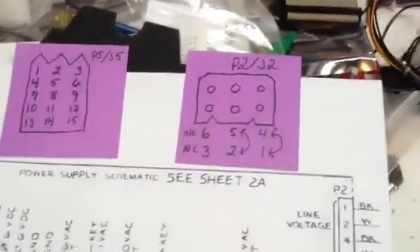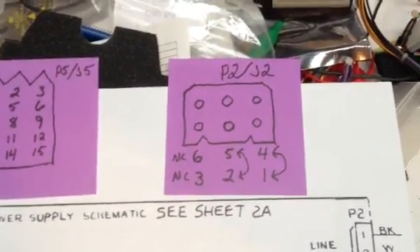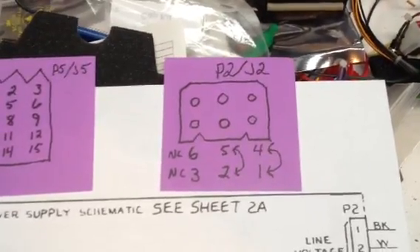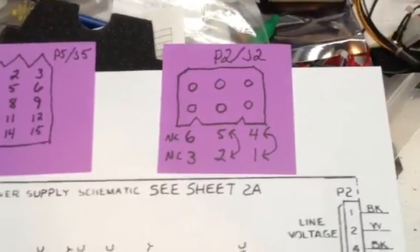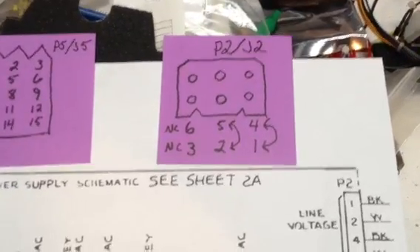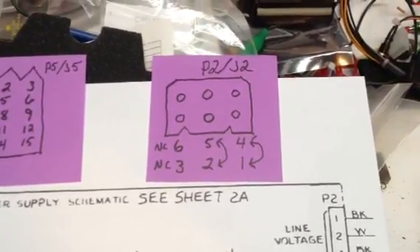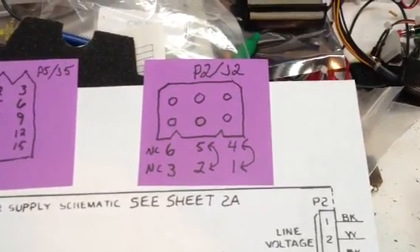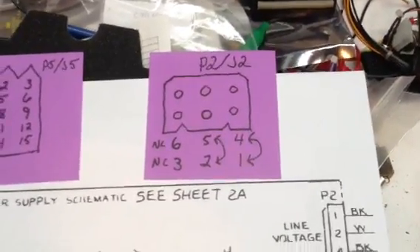The pin-out on these things I've drawn — and I'm not the world's greatest artist. You can see the big mess on my test bench; I've been fixing so much stuff for so many people lately that I just barely have enough room to work. The numbering for J2 is just as you see it in my little drawing there in purple. There's no connection at position 3 or position 6 — nothing needed at either one of those connections.